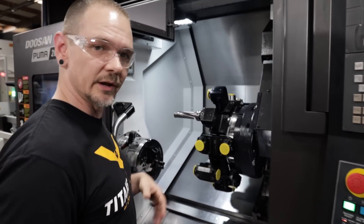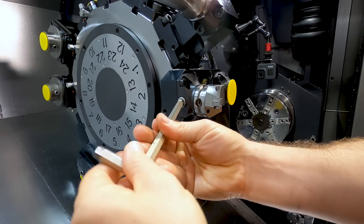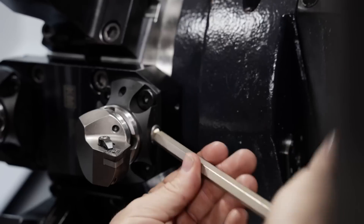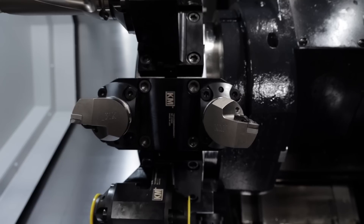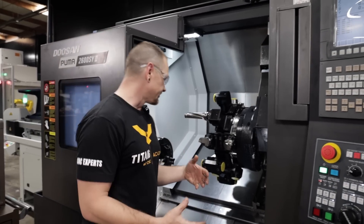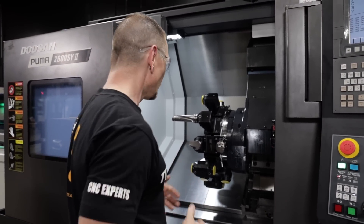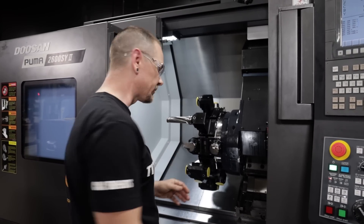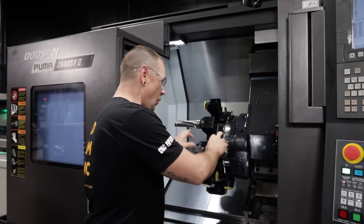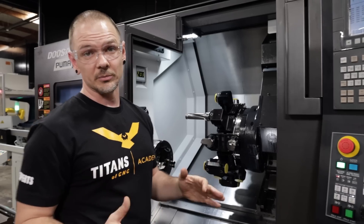Next up, we're going to go ahead and install a pair of turning tools. You'll notice we have our tool turned upside down as opposed to this tool right here. That has to do with the handedness of your tools — that is, a right or a left handed tool. We have two right handed tools, so in order to use this properly, we have to flip this one up. The basic idea is just understand what handed tools you're using and which direction you have to spin your spindles in order to utilize those tools properly.